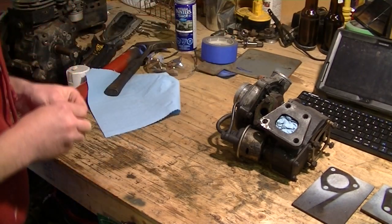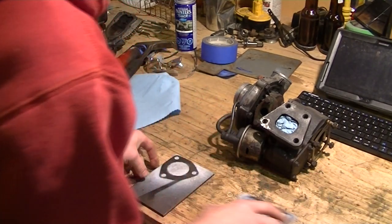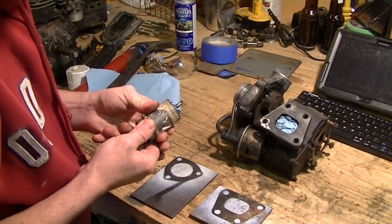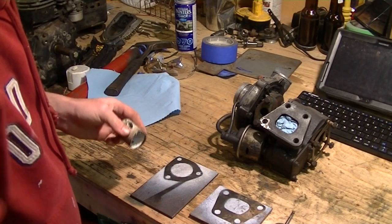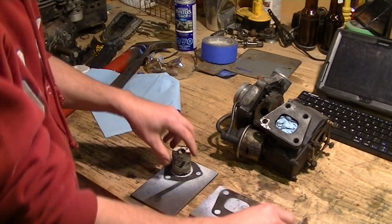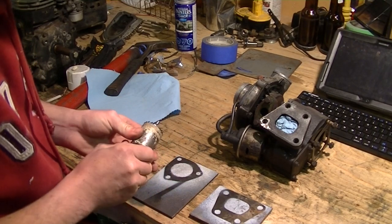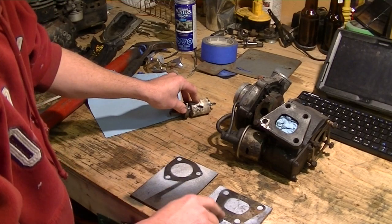The next thing I'm going to do is prepare these flanges, get them ready to go, get them drilled out. I've already selected a hole saw size that worked for the diameter of the pipe that I'm going to use, so I'm going to wind up racking this into my drill press and cutting a hole. And I've center punched the bolt holes for this flange. I haven't done it for this one yet.